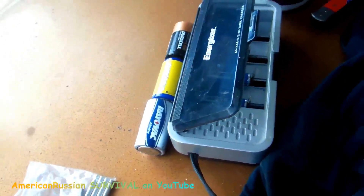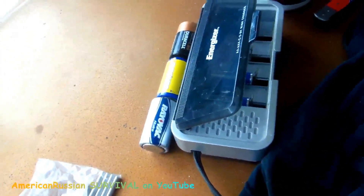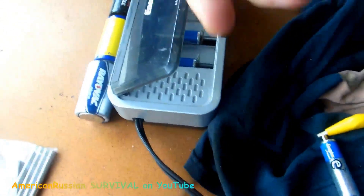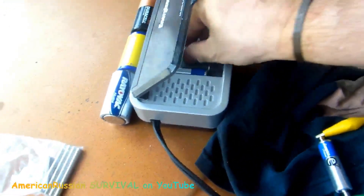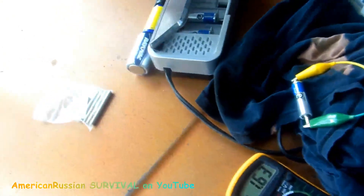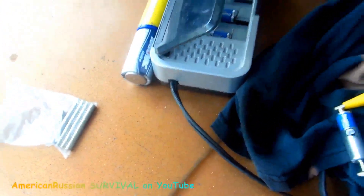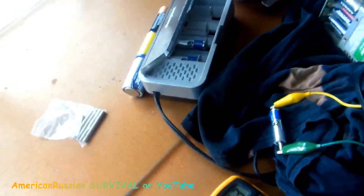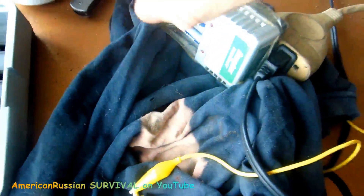If you're a survivalist and don't have money for a $300 charger, the Bedini charger also requires pure sine wave — you can't run it off a generator or modified sine wave inverter. But this cheap Energizer charger you can run off your generator or a modified sine wave inverter. Watch the smaller batteries — the smaller the battery, the easier it is to fry. The big lantern batteries — 12-volt and 6-volt — no problem recharging those several times. I've had very good luck recharging Rayovac D-size that way.